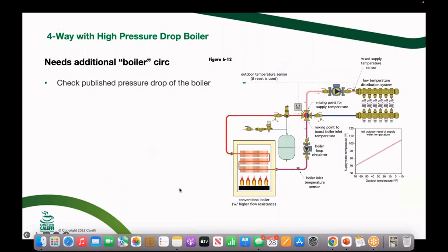We had a question from the audience: Caleffi offers three-way mixing valves but not four-way mixing valves in North America currently. He also noted that intelligent controls for mixing valves can be hard to find in North America. Tekmar is still out there — I consider them one of the pioneers in outdoor reset and mixing valve controls. They still offer valves with actuators and the control. You really need three components, and some competitor pump companies make a valve with it built right in.